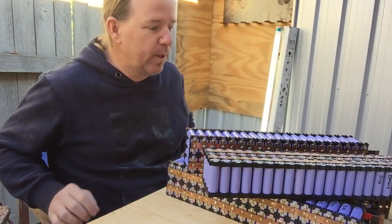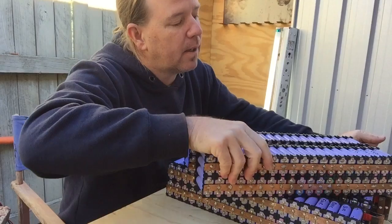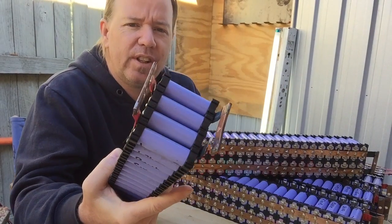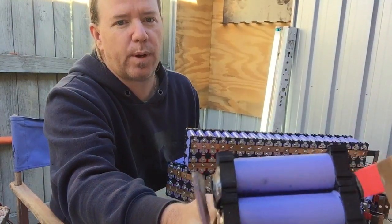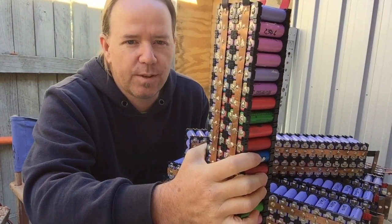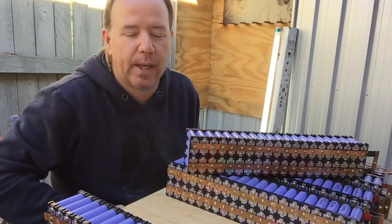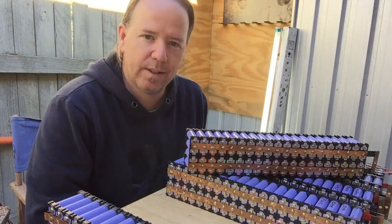That was a worthy little test — it took about an extra 45 minutes to pull it all apart and go through each one, but we found some issues. Banks one, five, and six all have broken fuse wire — I haven't done something properly and I really need to address those bus bars. Bank six is the one that's flapping around. The other option is that my engineer has a spot welder, so I might actually take it down and spot weld it. It's not a little eBay toy, it's a proper industrial unit. So I'm going to fix all these little issues.